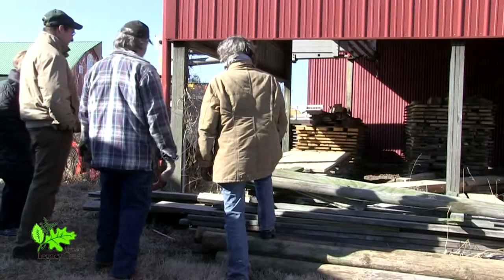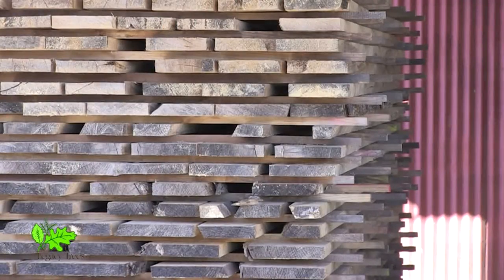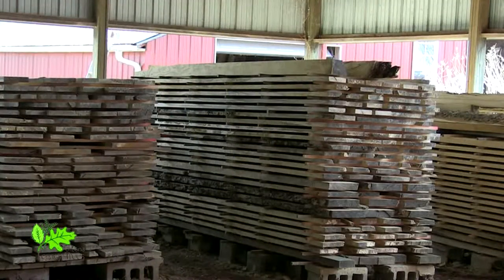After years of experience at the Autumn Mill, the Allens have the drying process down to an exact science. They're stacked with what's called stickers. Each one of those are three-quarter by three-quarter inches, about four feet long sticks made out of ash, which aren't reactive to most wood. Ash will not react with other wood, so you won't get staining and stuff like that. That gives you good airflow between all the stacks, and that's what you want — airflow on all sides of your boards in order to keep it from getting mildew and fungus. And Hackberry is particularly prone to staining, so you really need good airflow on it.